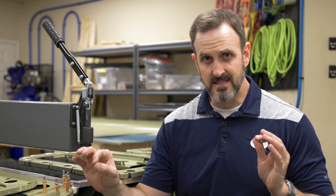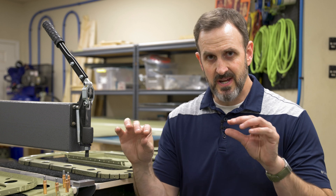For the last part of this video I'm going to talk about how I riveted the trailing edge of the elevators. Riveting the trailing edge was something I've been worried about for a while because if you do it wrong it ends up really wavy and not straight, and you have to make a whole new part. After studying a lot on Van's Air Force and other forums, I did what a lot of people do: after letting the tank sealant set up, I put all the rivets in place with the manufactured head on the top side, put some rivet tape on it, then turned it over and riveted in stages. You don't want to squeeze each rivet all at once because that puts a lot of stress on the surrounding structure and can cause distortions.